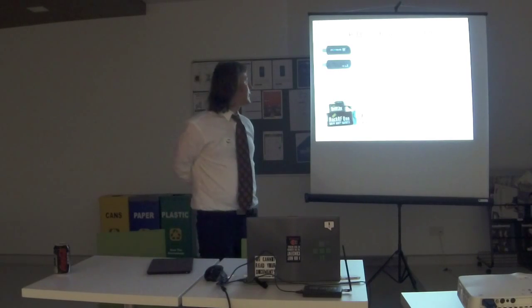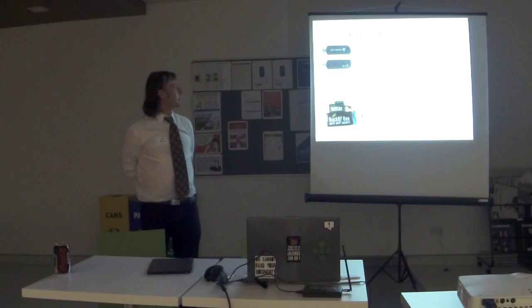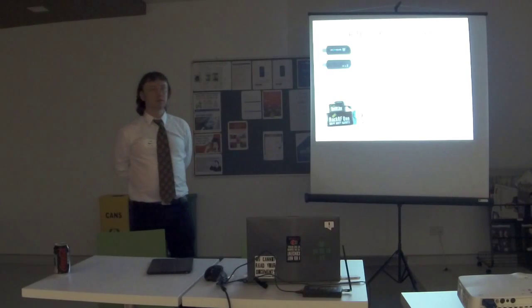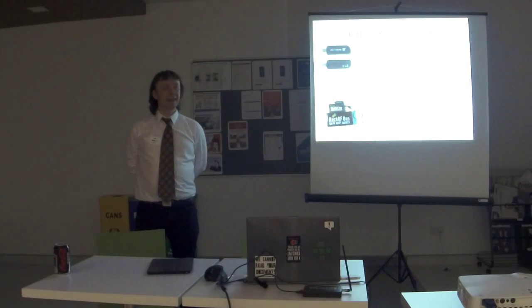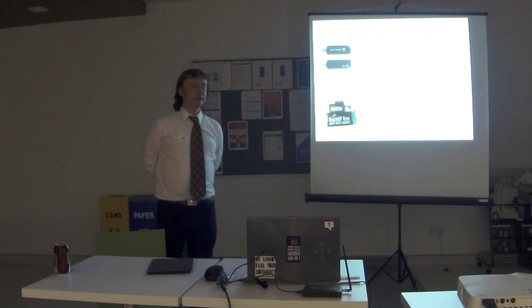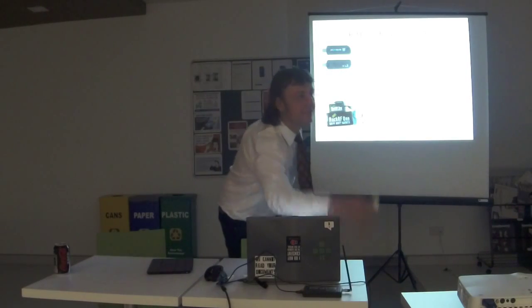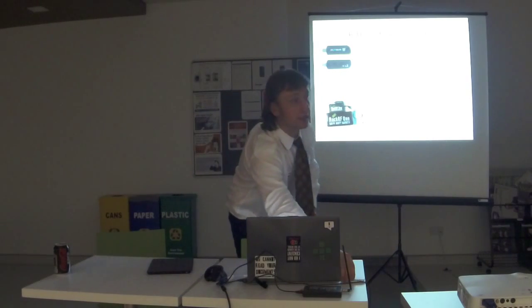So what do they look like? First, on the top, we see the most popular device, it's RTL SDR. It covers approximately between 50 megahertz to over 2 gigahertz. And it's really a stick. I don't have one with me because I brought HackRF, but if anybody wants to compare, it's just like this stick. It's the same size, except that it's receiver only.